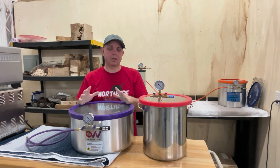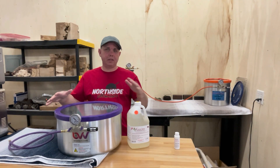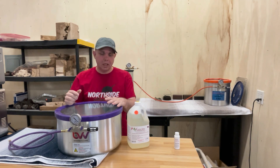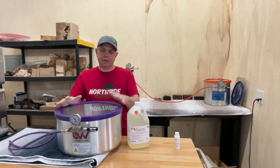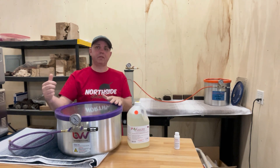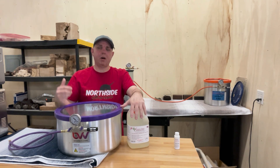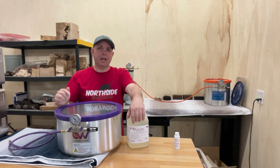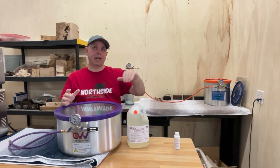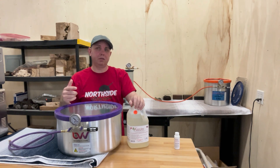I have a couple other questions I'd like to answer before we wrap up. I put out a wood stabilizing video on this whole process, probably a couple years ago, and I'll put a link up there and below. One of the questions was: when you're getting the bubbles out and you come to full vacuum, can you just shut it off and turn the pump off? It clearly states to leave the vacuum pump on until the bubbles stop. That video I did — I don't know if it was the piece of wood or the last formulation of cactus juice — but it took forever, hours and hours for it to stop bubbling.